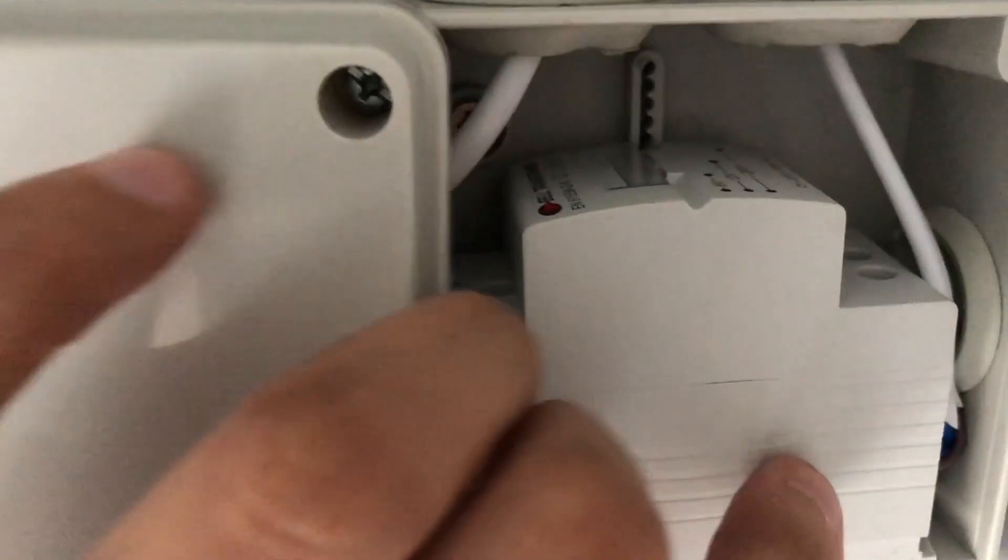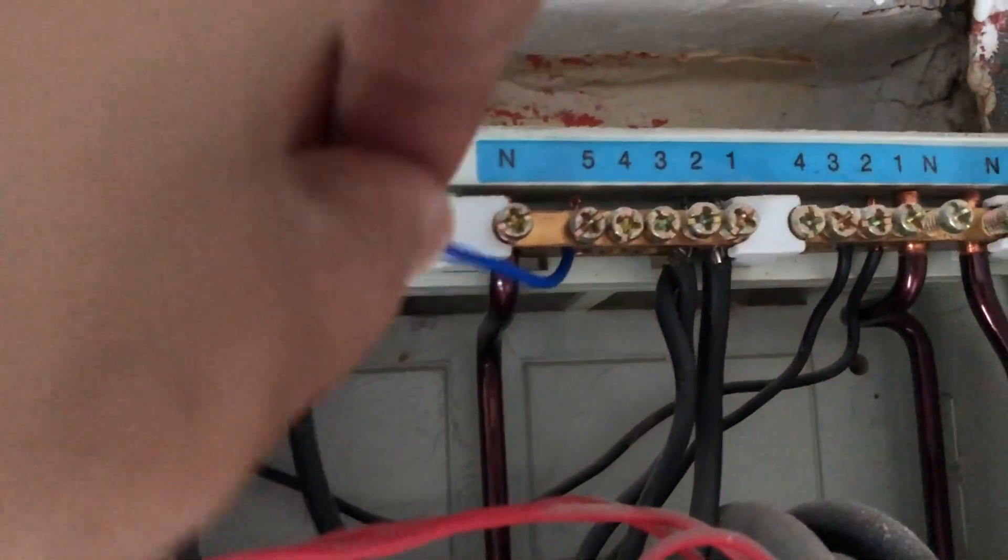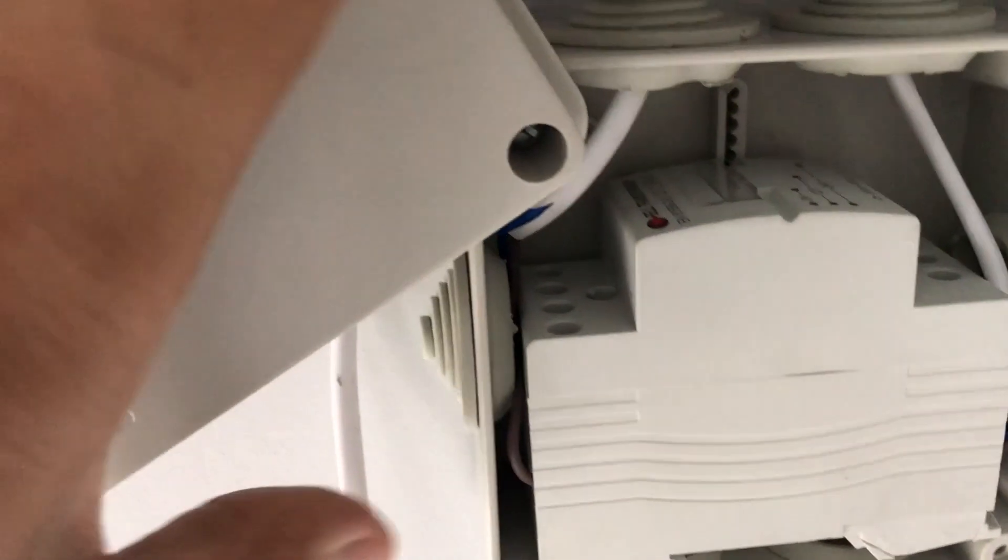This is the 24-volt transformer which I got — I've got a link in the description below. What I did was run two wires from the 24-volt output over here, and I ran the 240/230-volt from here and passed it through the fuse box. I put the brown in the red line — it really doesn't matter which you use, just tuck that in. Then from the transformer you run the 24-volt wires out here — this is where I'm running the 24 volts coming out. That is the transformer done.